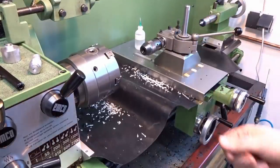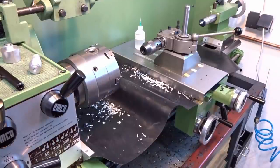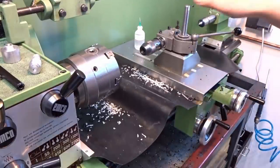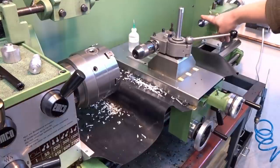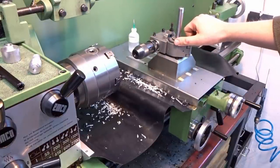Or if you're drilling material that's particularly prone to grab the drill like brass, you can just power feed it and have a very controlled entry into the material. Also you don't have to drag the tailstock in, which is bloody annoying because the bigger the lathe the heavier the tailstock gets. Even on this Emco, when you're working back here and you need to drag the tailstock in and out to get clearance for your tool holder, that's annoying. The carriage handles all of this without a problem. The only case when I use the tailstock for drilling is maybe for very large drills and extremely tough materials, but I even run rotary broach drills up to 40mm in stainless steel with the tool post.